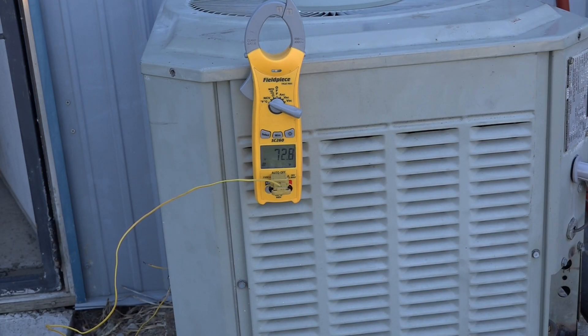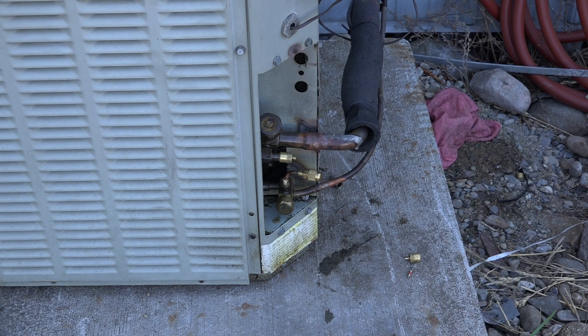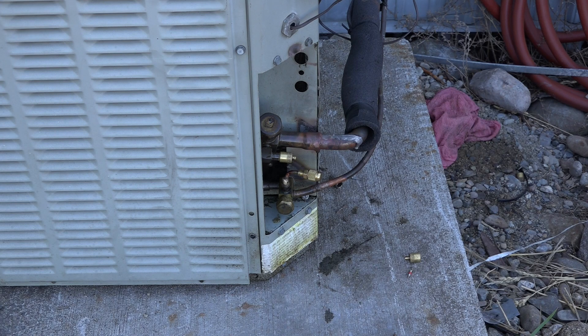What I'm trying to do today is give you an idea of how to check charge on a preseason service on an air conditioner. We've got a pretty mild day here, about 72 degrees outside, inside temperature about 71 or 72. I want to check charge, but I really don't want to put the gauges on every time — there's some refrigerant loss, and you can cause leaks and other issues. The more you do something, the more chance there is for a leak, so I like to check these things without putting my gauges on.